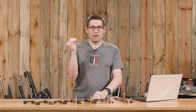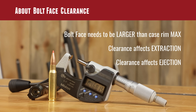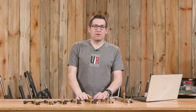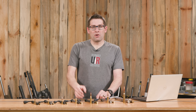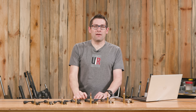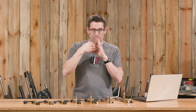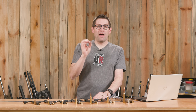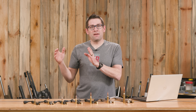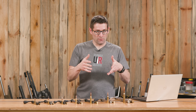What we do need is good engagement between the extraction claw and the case rim so that after pressures lower and brass contracts a little bit from peak pressure, it can be withdrawn from the chamber, extracted, and then ejected. Bolt face clearance also affects ejection — the cartridge flying out. The position of the ejector pin and the extraction claw are critical in terms of clocking to make sure the cartridge flies free of the ejection port. If clearance is too tight, the case rim can bind on the bolt face when it tries to fly out, which can definitely be a problem.